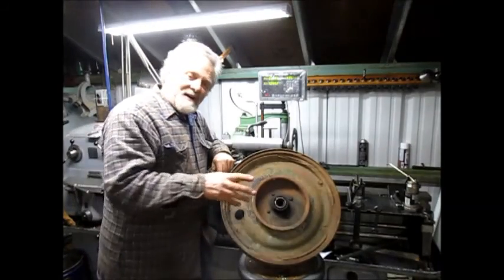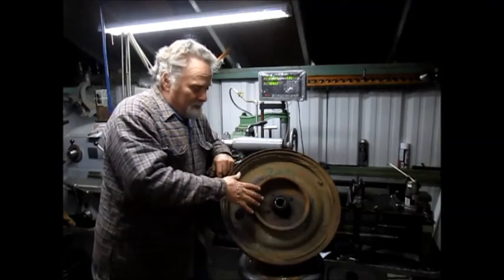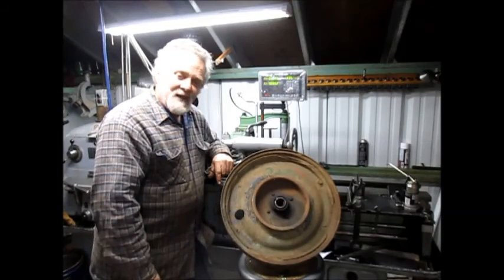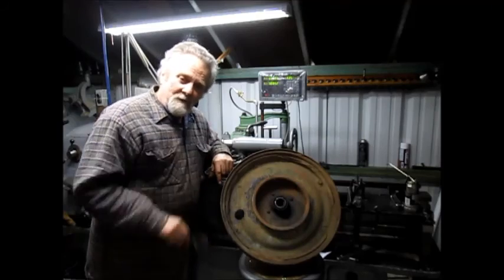And it turns out that I have a gap lathe. So we're gonna pull the gap today. We're gonna mount our brake hub here and go ahead and turn the surface so that they have a nice clean brake surface. So stick with me, we'll have some fun.